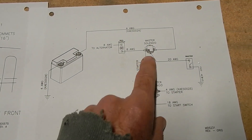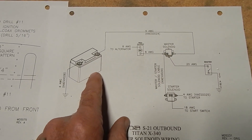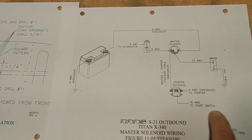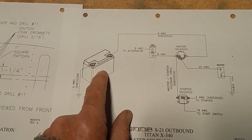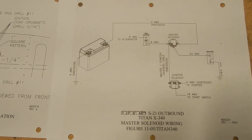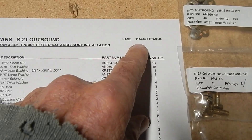I like that installation, so I'm going to go ahead — I've got to take that battery box off and install a bracket onto it and mount the master solenoid on that bracket. I'll run a short jump wire from the battery to the solenoid and then my long wire up to the panel, which will only be live once I activate the master from the ground wire that goes up to the panel. It seems like a safer and better installation. The parts page is 11-A01 and 11-A02.